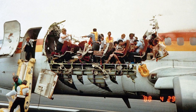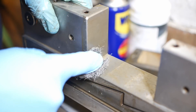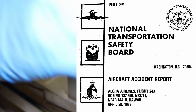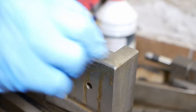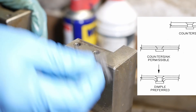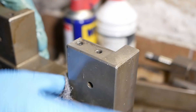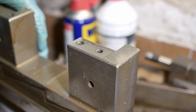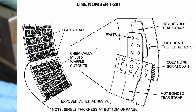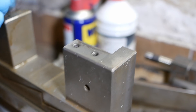A lot of people think that the Aloha Airlines Flight 243 — the one where the top of the plane blew off — was a scribe line accident, but actually it wasn't. I looked up the NTSB report. That one was more caused by the very thin skins used in that location being cut-countersunk instead of dimpled, the extremely high cycle operation done by Aloha Airlines, compounded by a severe corrosion environment, poor maintenance inspection practices, and I think there was also some issues with the debonding of the bonded lap joint kind of taking away the aircraft's fail-safe protection.